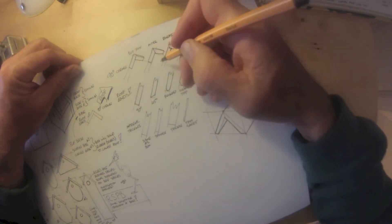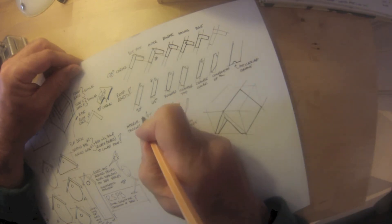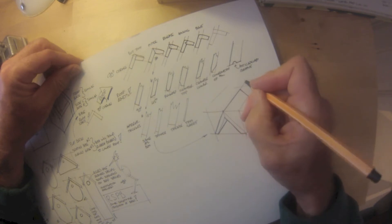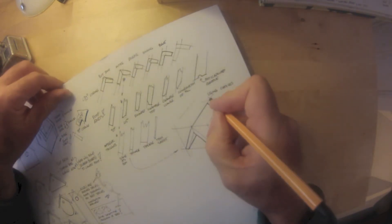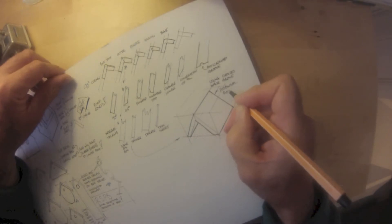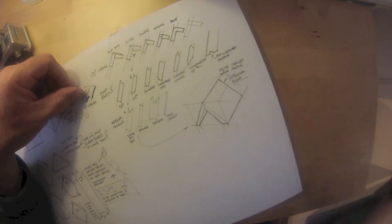This example takes the top idea of a mitre and the second row taking a 45-degree cut at the bottom, using the same thickness as the box — so taking points one, two, and three gives us a possible roof structure. By making those three choices you can assess that different combinations are possible: for example, a rebate joint on top, a rounded roof, and thicker material would give a completely different-looking roof structure. This idea of mixing choices generates a whole range of possibilities.